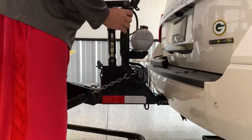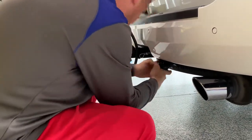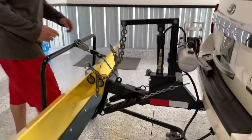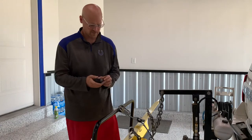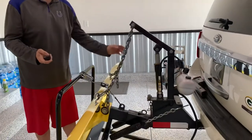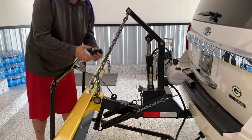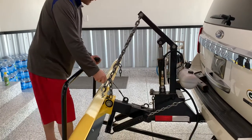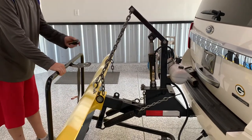I've got it hooked up to a trailer plug for ease of plugging in, and then set up with a wireless remote system — very simple, used on winches and dump trailers. There's a little power switch on the side; flip it to the up position. Then we're just going to take the weight off of the stand with the chains, use the remote, pop that off, and stretch it out to give you some slack, then lift it up just a little bit more.